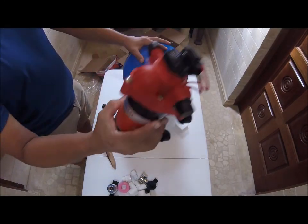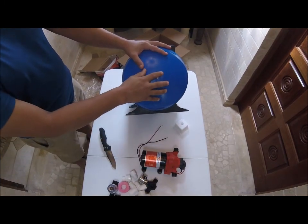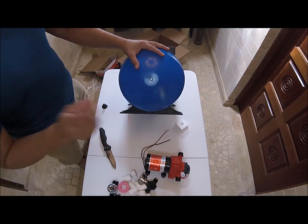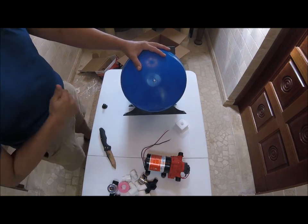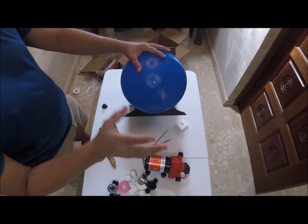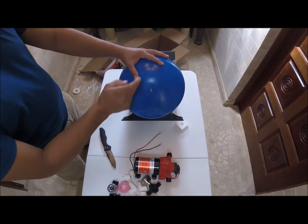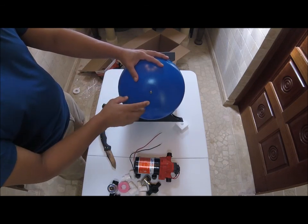Now here's the inside scoop. For these pumps, I believe you use 18 PSI for this type of tank. If you're going to hook this up to this, it's 18 PSI. I would dare take it all the way up to 20 pounds for this tiny little pump. If the pump is a Seaflo 7 gallon per minute, I would even dare take it to 24, but I wouldn't exceed 30 pounds. 30 pounds would be pretty much normal for a regular AC pump, 28 to about 32 pounds. But this is a 12 volt pump, so we're going to hook this up with 18 PSI. We're going to use a test gauge to set it to 18 PSI.